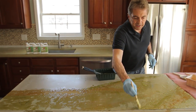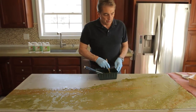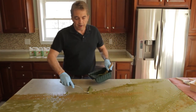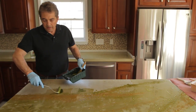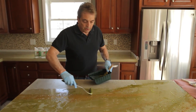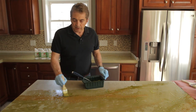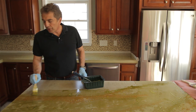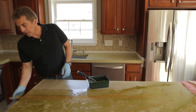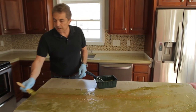And depending on what kind of sealer you use, if we were to put an epoxy sealer on this, it would darken this up immensely. I mean, it would almost turn this green to a very, very dark green. The epoxy finishes really darken your tones that you're working with, where if you used our Cyacryl 14, it's more of a natural finish. Or if you use the water-based Aquapoxy, that's the same thing. It's a very natural finish. It doesn't affect the color very much at all.